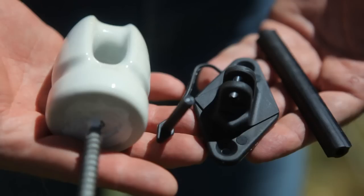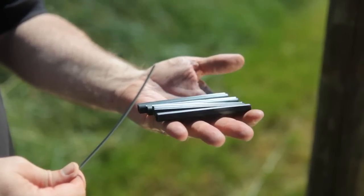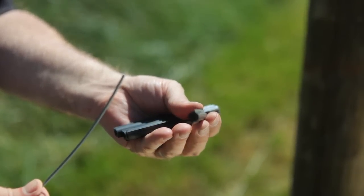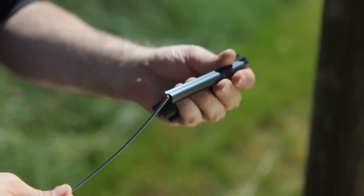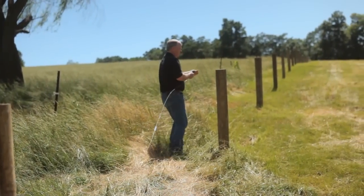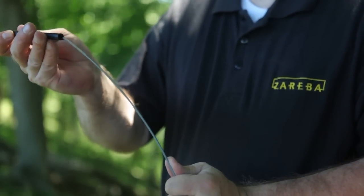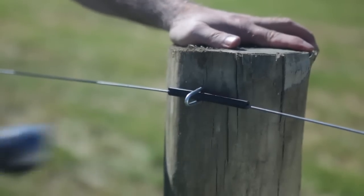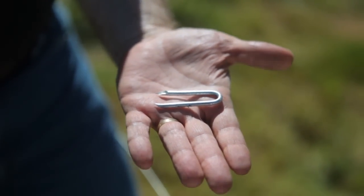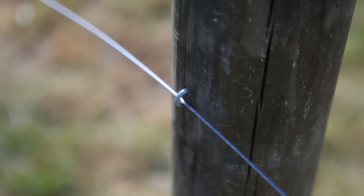You have several options to insulate the electrified wires at the line posts to prevent voltage loss: thin tube insulators, porcelain insulators, and plastic insulators. The most commonly used are thin tube insulators for high tensile fences, which can be used on wood posts. These 4-inch hollow tubes have fins on the outer edge, which hold them in place on the post while allowing the wire to move freely through the tube. These tube insulators should be put on the wire before both ends are attached — simply place the insulators on the wire as you pay it out. It is a good idea to put extra tube insulators on the wire before the ends are connected in case you miss adding any. Thin tube insulators attach to wood posts with a staple; be sure to use 8 or 9 gauge, class 3 galvanized barb type staples for longest product life. Drive staples leaving a quarter inch gap, allowing wire to move freely beneath it.